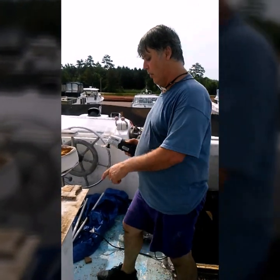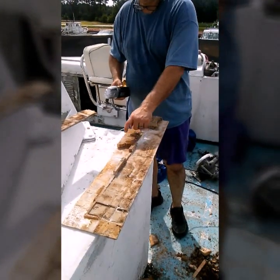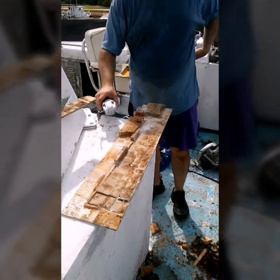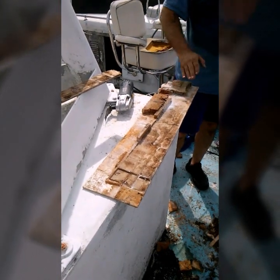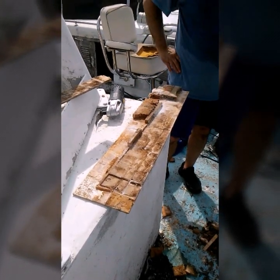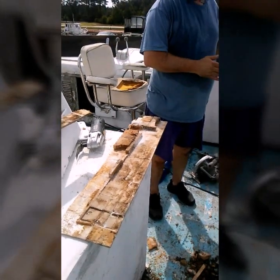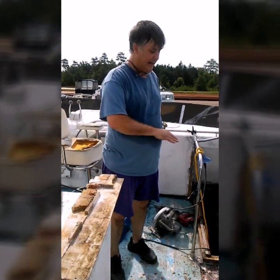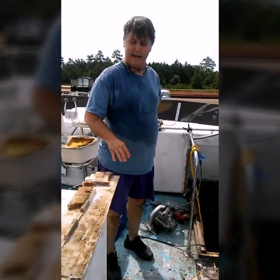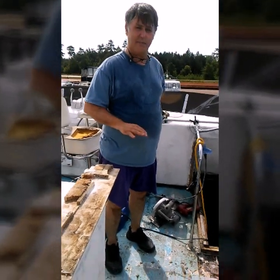You have to do that on both sides of the fiberglass and then on the deck — what's left underneath, which is another piece of fiberglass. You have to do that to strip the old wood off. This wood here is still solid. I'm going to strip it all the way back to where I cut, until I was in the solid wood — about twice the distance into solid wood. I'm going to cut a piece of plywood, epoxy both sides, and epoxy-bed it in here. Then I'm going to re-glass it back in using the panels I've already cut.